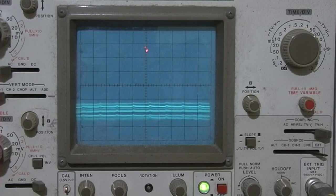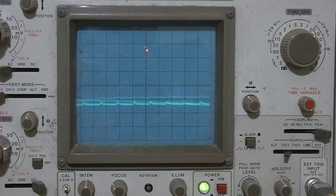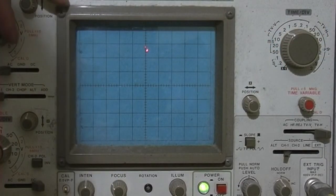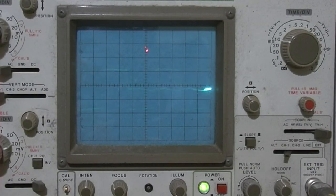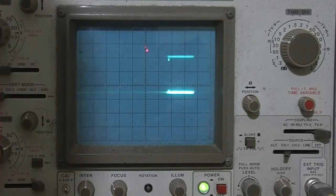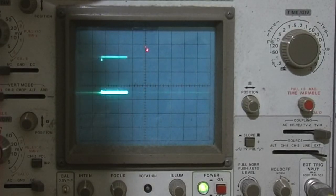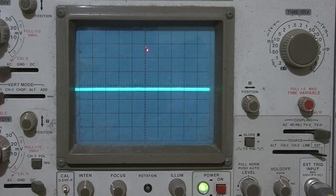The flip flop signal, the drum flip flop, I don't want to trigger from the drum for that. I don't want to trigger from E for that. Pin 7 of IC207. That, and line sync pulses. So I can trigger from that for that. Yep. 2.5 megahertz oscillator. See if that's running, that's pin 17 of IC208.